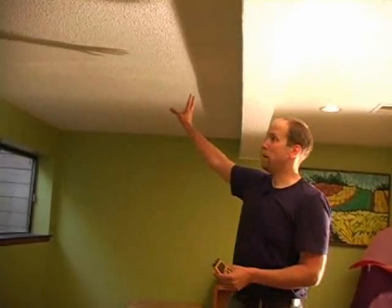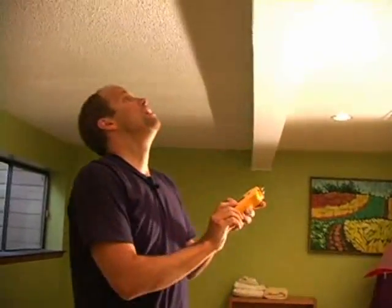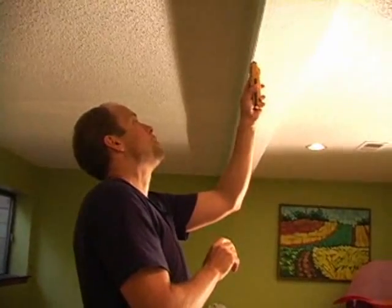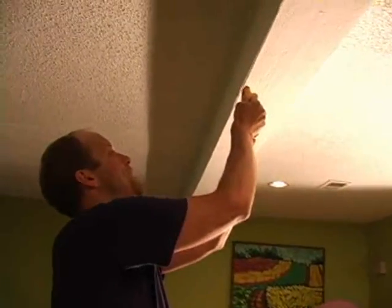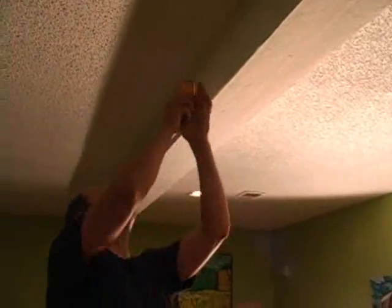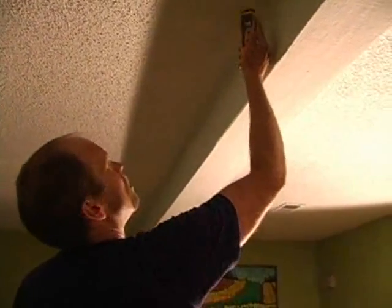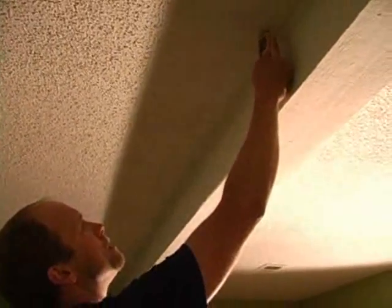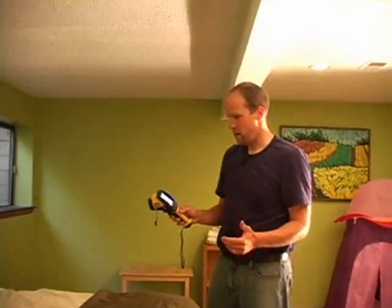So there's definitely an active water penetration problem here. Probably the deck problem. There could be a flashing or a roof problem that's underneath the deck. And remember those watermarks? Slight elevation in moisture. Nothing too serious though. Here. It's all green actually. A little bit there, a little bit there. Not bad.